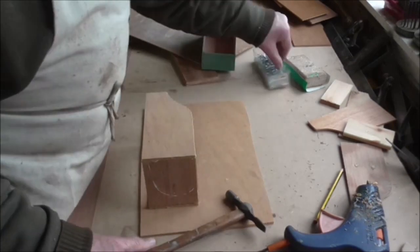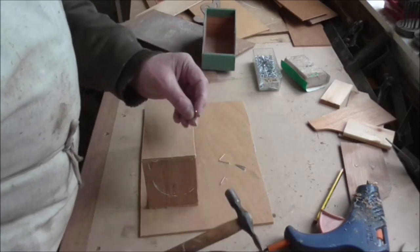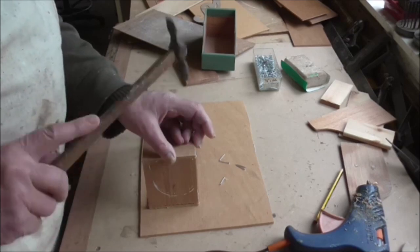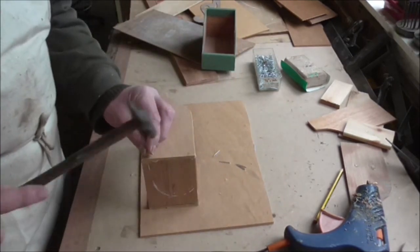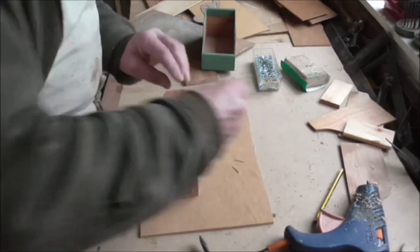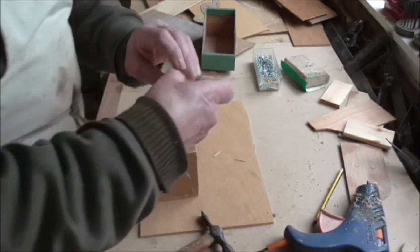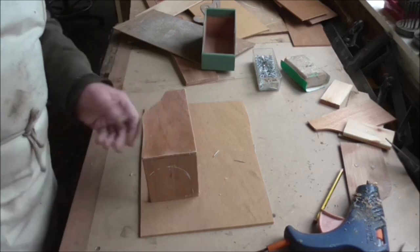Now it's up to you, but sometimes it's a good idea to get a little hammer and a few small nails or panel pins. These are little galvanised three-quarter inch nails — just pop a couple in, especially the back where it's higher. It doesn't do any harm. You don't have to do this, but it just makes it that little bit stronger. You can only do this if the back piece is thick enough to take the nails — if you use very thin wood for the back, obviously you'll just have to rely on the glue.